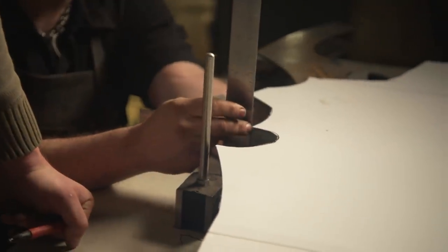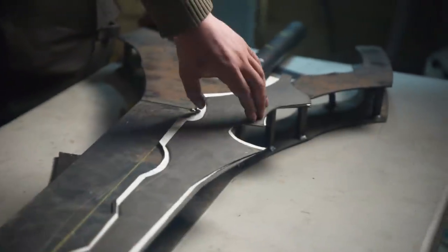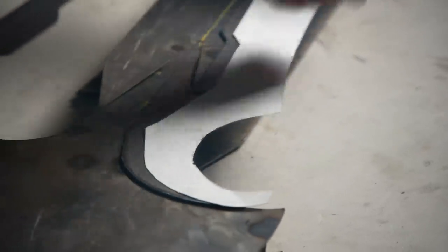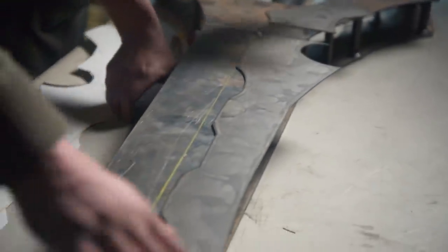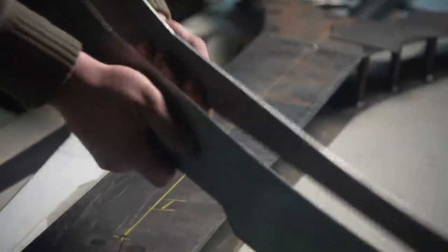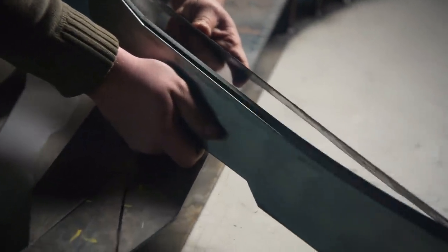After a whole bunch of arts and crafts between me and Decker, we started with this — our over-top blade profile to see how far it would actually stick off the body of the sword. Then we made up this paper profile to figure out how much steel we needed to make the bevel of the blades. We gave that to Kerry and he got to cutting. We chopped it into a couple of different pieces to make it a little easier. We're going to take this piece of quarter inch, bevel it, and that will give us a little bit more bite to our blade.